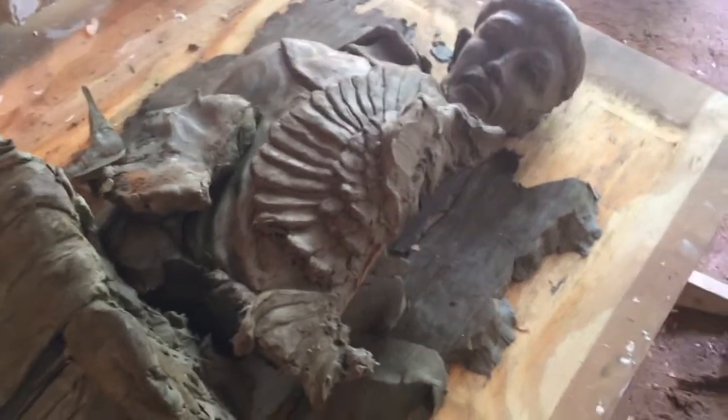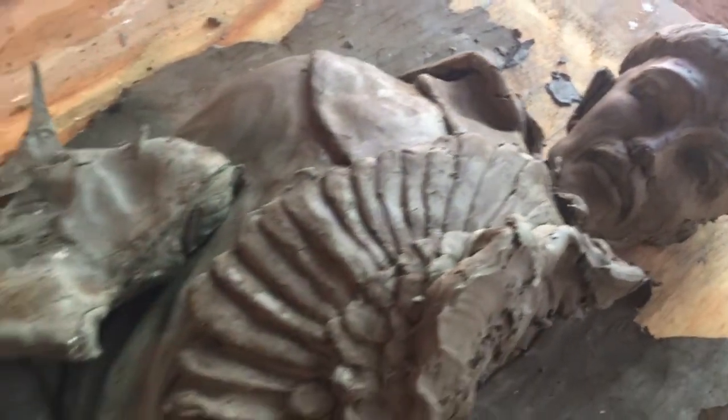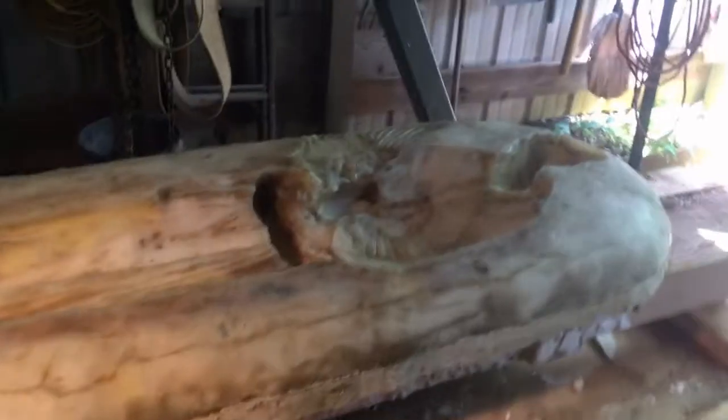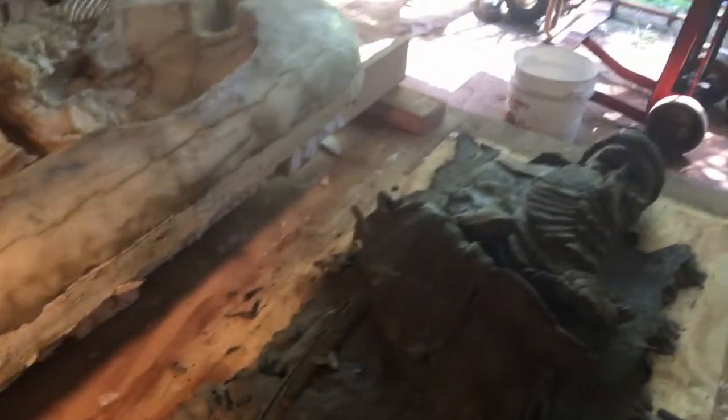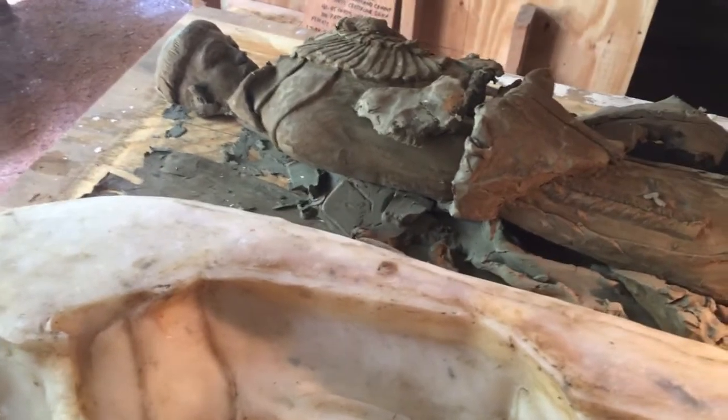If you can see that, aside from him being taken apart, this silicone mold doesn't bugger up any of the details. The problem you'll have with the silicone mold is you'll break the mother, and then the mother won't be there to hold it in rigid form when you do your casting work. First thing I'm going to do — we took this off and washed it a little bit because it had some dirt that was on the clay, because the clay was old and had been sitting around for a few years.